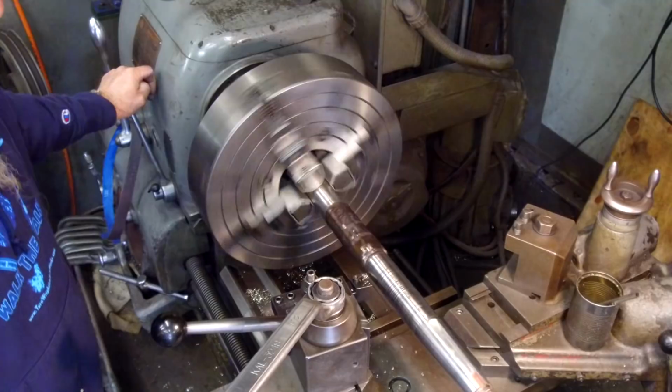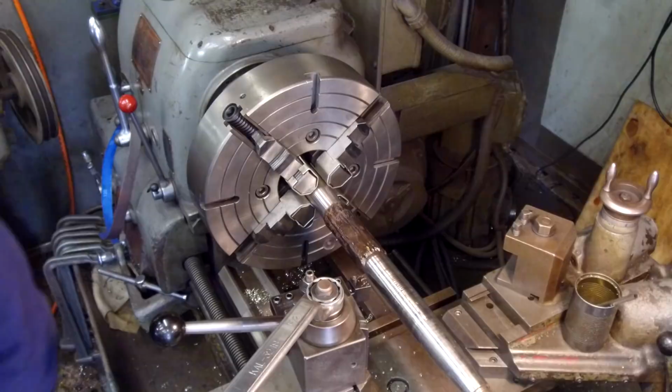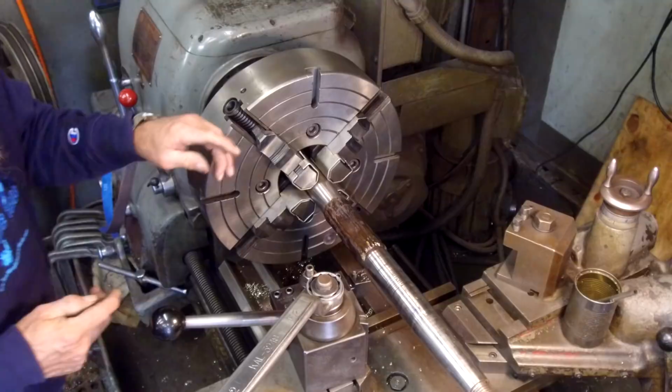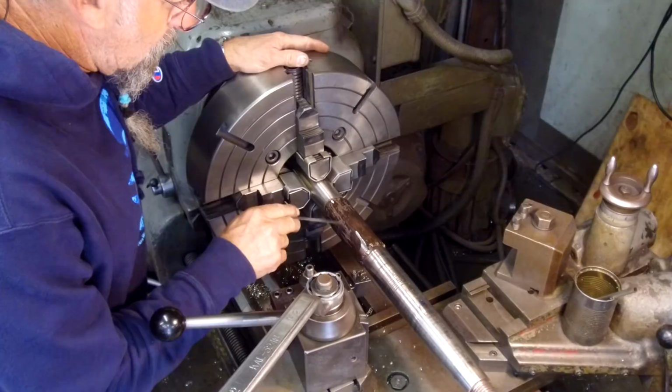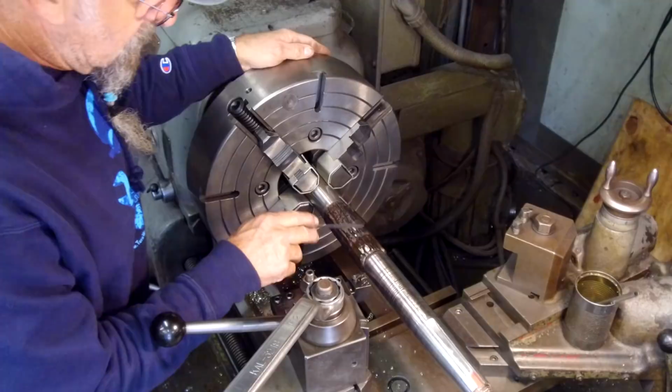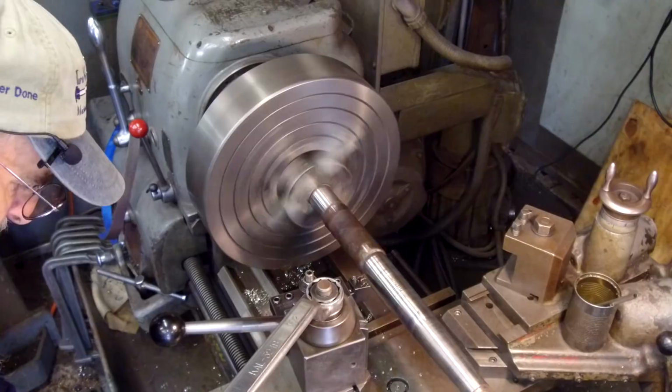Okay, this is one pass of weld around. Let me find my scale here. Now, I touched and took 50 thousandths off of that. Right now, I have 1/8 of an inch per side from that surface there. Of course, some of this weld is not being skimmed right now, so it's a little bit less than that. But all these high spots are still 1/8 of an inch from those spots right there. So I'm going to take another 50 thousandths.